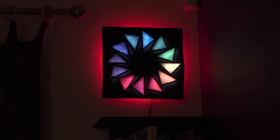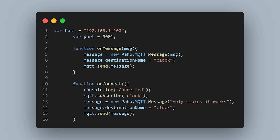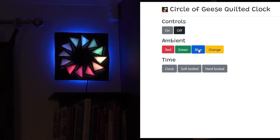The Raspberry Pi is configured as an MQTT broker with Mosquitto, and as a client using the PAHO MQTT Python library. It also uses the Apache web server to host a simple HTML page with embedded JavaScript that creates an open WebSocket to the broker on the Pi. A user's button press triggers a message to be published to the waiting Python script, and the end result feels as instantaneous as a wall-mounted light switch.